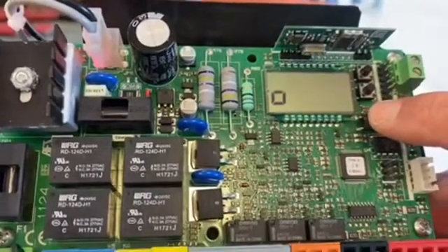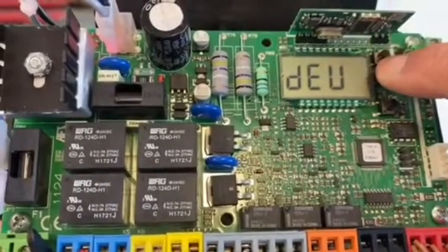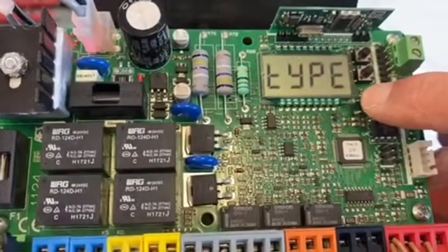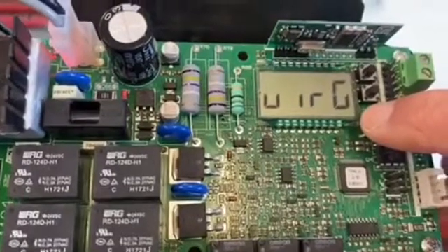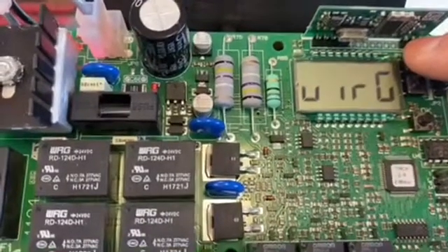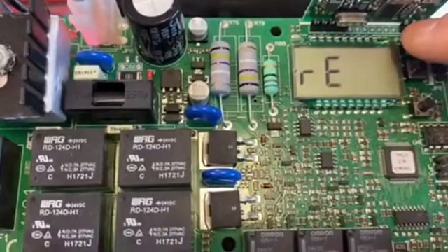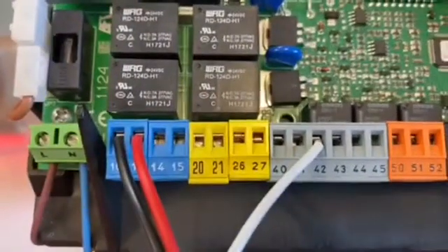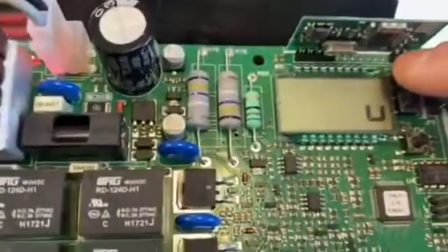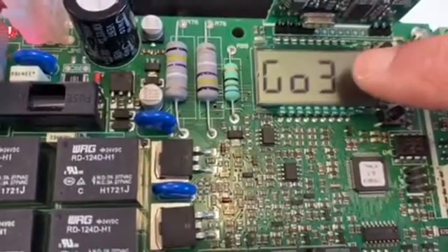One tip to auto-set this motor: hit the OK button once, select your language — English, Spanish, whatever — then go to English for Australian customers and press OK. This is the important part: select Virgo 3, because I'm using the three-wire connection. Virgo 5 is what you would select if you hadn't manipulated the cables. Since I have, I go down to Virgo 3, three-cable, and hit OK.